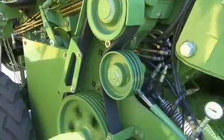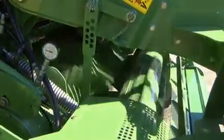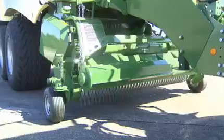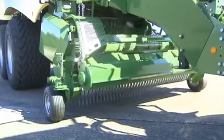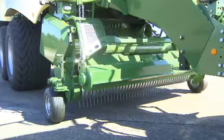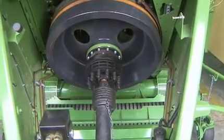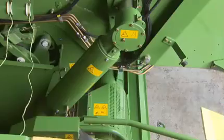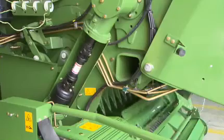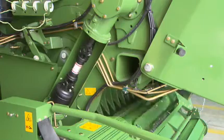This driveline concept offers a number of clear advantages. It reduces the baler's input requirement substantially, and the current wheel slip and load are displayed to the operator. Also, the shared rotor cutter and pickup driveline is cut when the load is excessive. The pickup on VFS machines is powered directly by the main gearbox and drive shaft, and is protected from overload by an integral cam clutch.